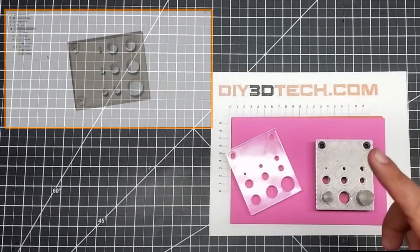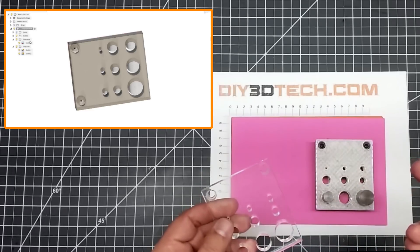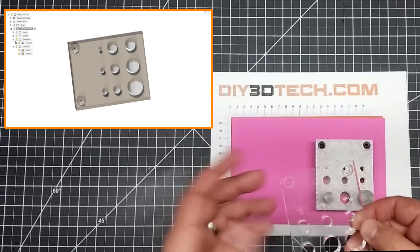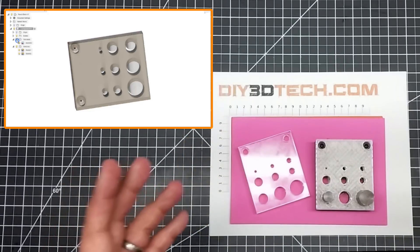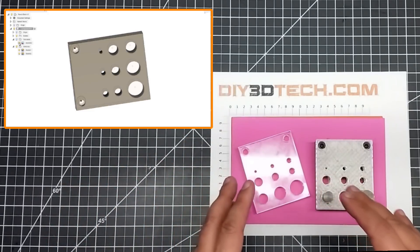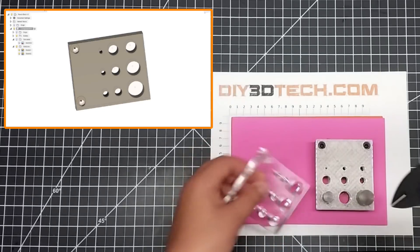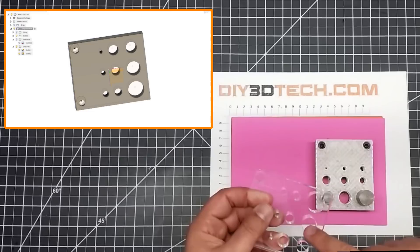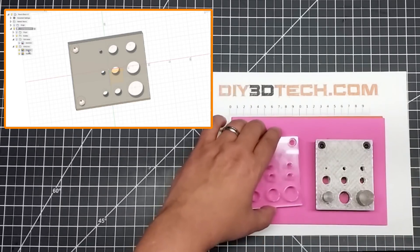I have a little bit of that up in the corner. So I took a scan of this, which I do a lot for Inkscape, but now that I'm doing more work with Fusion 360, I brought this into Fusion 360 and used the calibrate command to calibrate the size of this and did my layouts, then took a set of calipers and measured all the cross sections and created a new one.